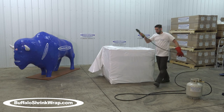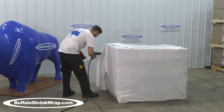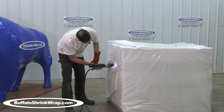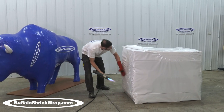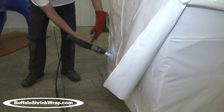Once all the openings are welded and seamed shut, the entire surface is evenly heated, similar to spray painting. The shrink wrap will cool and shrink drum tight. Where the material does not stick to the item, it shrinks tight around it and is easily cut off.